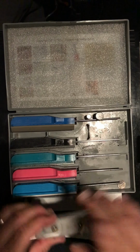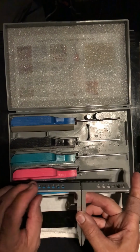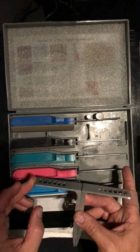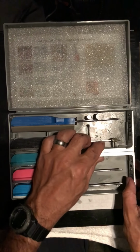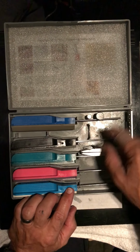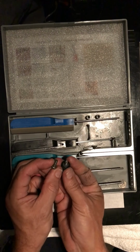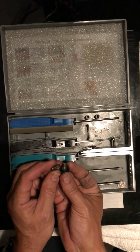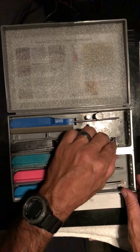So that's your jig. Most of them are made out of aluminum or heavy plastic. Be careful you don't bend this or step on it or mess it up, because that'll mess up your angles on either side. Got to keep your jig straight. You can see the bigger knobs here are for doing bigger jobs. There are also smaller knobs for your standard knives, 1/8, 3/32 kitchen knives, really thin stuff. You use these two to hold your jig together and to bind. I'm using the big ones right now.